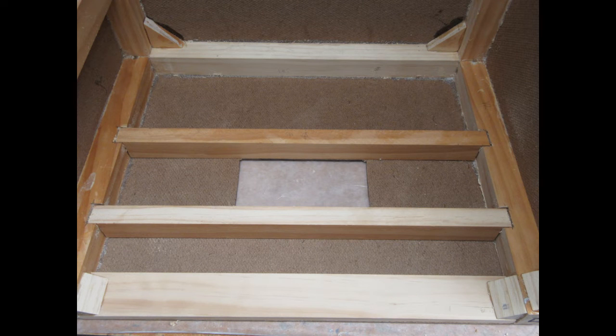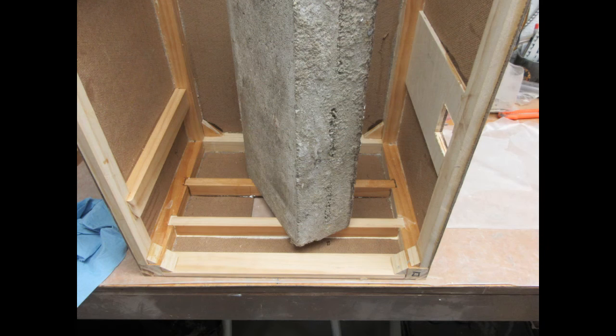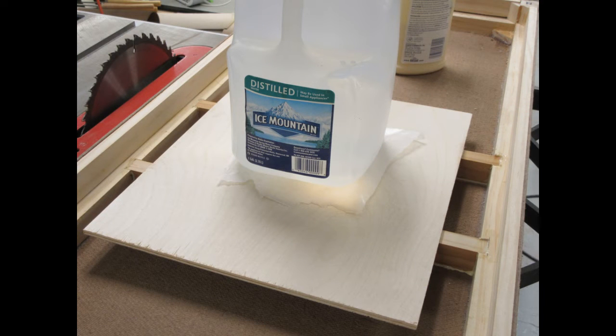The two rails for the end handles are cut into the frame with rabbet joints. Regular wood glue is used, and a heavy weight presses the joints together as the glue sets. Two more similar rails are used for the top carrying handle, and here a scrap piece of weighted plywood spans the rails as the glue sets.